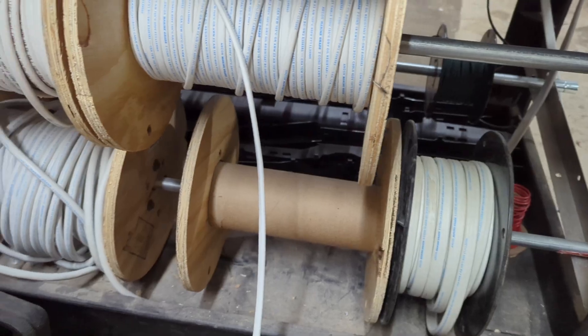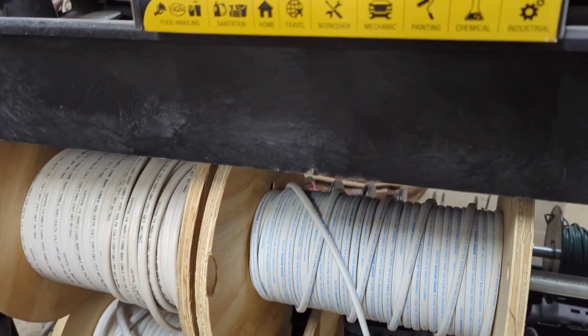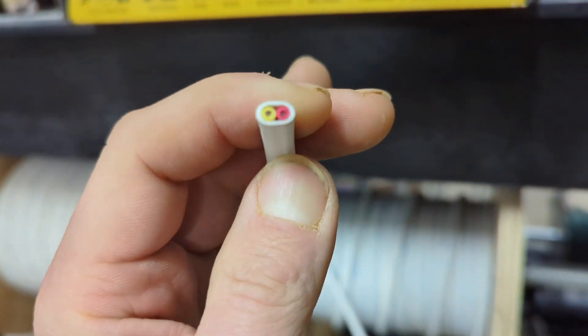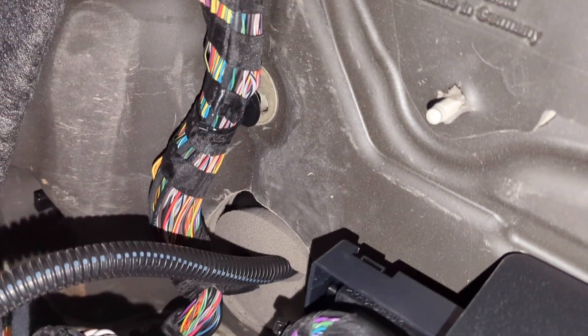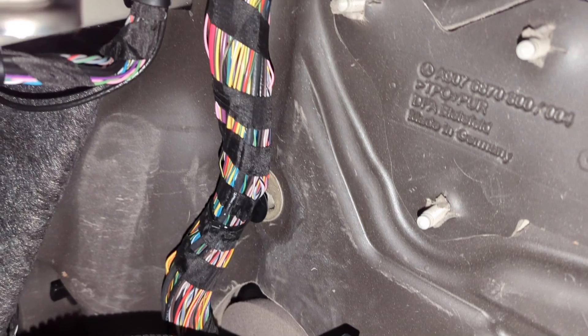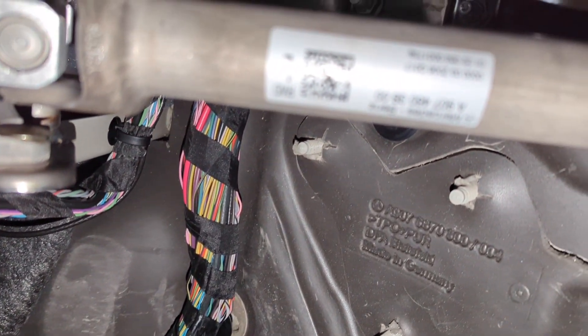One of the main wiring principles I've migrated towards is to imitate what I see car manufacturers do. Early on I would use duplex marine wire with its own sheathing, but now when I look at the way Mercedes or Ford wires the Transit van, I see them use a lot of attachment points to minimize any sort of movement and make sure wiring cannot vibrate around edges. There are tons of mounting locations and all their wiring bundles are wrapped in something called friction tape.